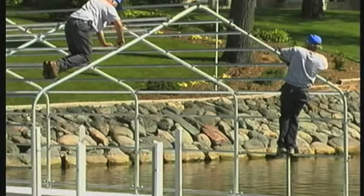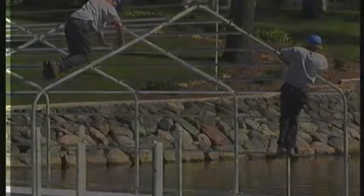For tightening set screws on the covered walkway side of the boathouse, notice the installer is standing on the outside end vertical post to reach above and as far as possible toward the top of the boathouse. You will tighten all of the set screws in the slat brackets with the exception of the slats that are out of reach. Three slats on the second and fourth canopy bows located 8 feet out from the slip turn and 8 feet in from the end of the boathouse.